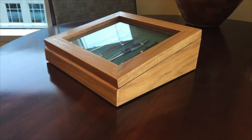It's got a lot to do with the sapwood not being considered a defect in walnut, so what they do is they steam the walnut while it's being kiln dried, and it blends the sapwood with the heartwood and kind of makes it look more uniform in color. The bad news is when they do that, it doesn't hold the color very long. I guess it depends on how much sun exposure the piece gets, but I didn't want my little candy dish looking like this after a few years.